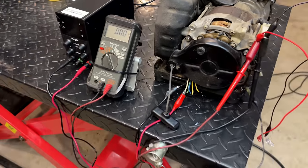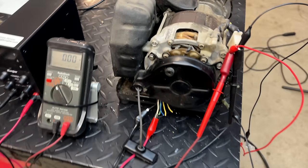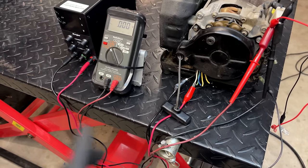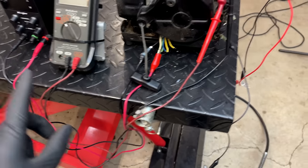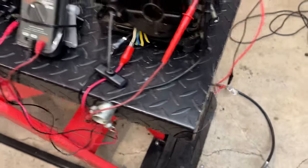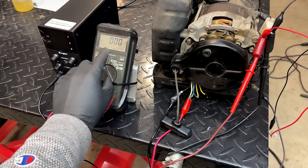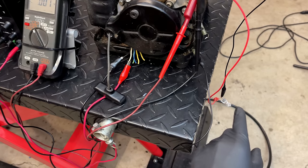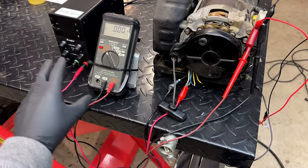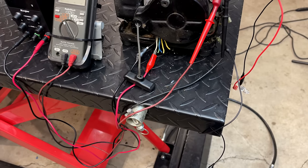Anyway, I did struggle a bit with the choke. It's just powered by a bimetallic strip, so it does need to warm up before the choke turns off, and it did finally turn off. So I'm going to do one more test. I've rigged up a 20 watt load precariously on the side here, so I want to get it running again without power to the field, see what the residual magnetism is with that light in circuit, and then we'll apply the power again to the field and see how much more voltage we need to get back to 120 volts.